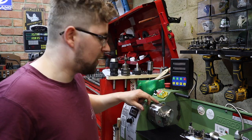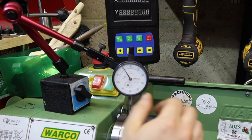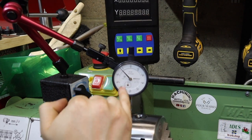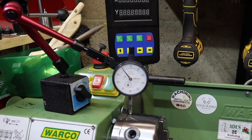The final thing I want to do is stick a DTI gauge on here and just see what runout we've got in the chuck itself. I've got my mag base stuck up with a DTI gauge, spanning across the chuck, already set to zero. Turning it by hand — it dropped a little bit there but that's because there's a stamp and some markings on the chuck itself. I'm pretty happy that we've got between 0.01 and 0.02 millimetre runout — so pretty much nothing. That about sums up this video. I hope you've enjoyed it and it's given you a little insight if you're thinking about stripping down your chuck for a service. If you've had your lathe a few months now, I'd highly recommend you do it. Thank you for watching — please check out my previous videos and I'll see you in the next one.